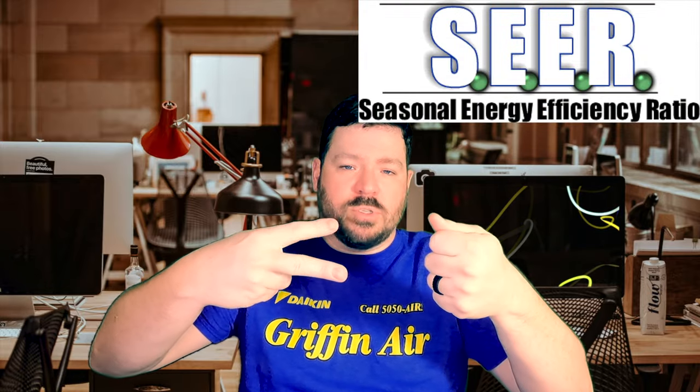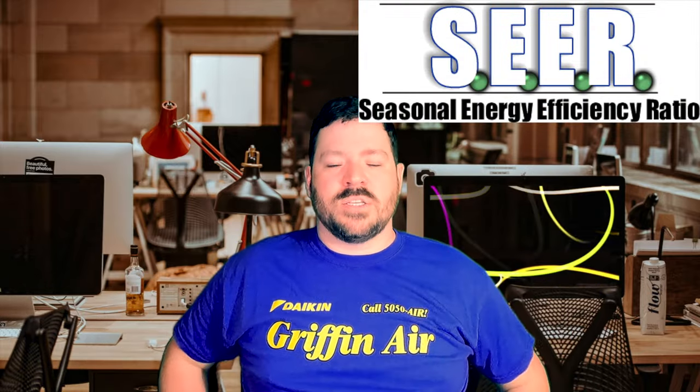We've talked about efficiency and sound. Now I want to dive a little deeper into SEER. Sometimes if you're trying to hit a certain SEER or efficiency level, you can get a rebate from your power company, or if the government has some sort of rebate program. Sometimes we'll see people go from one to the other based on that, because you can pair two different air handlers with the same outdoor unit. For example, the PSC motor system might only be 13.5 SEER, but if you pair it with a variable speed, you now have a 15 SEER system — a little more efficient.